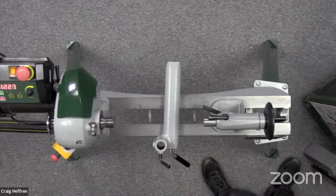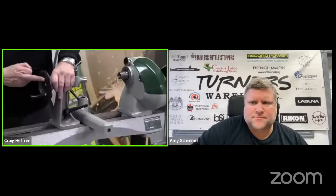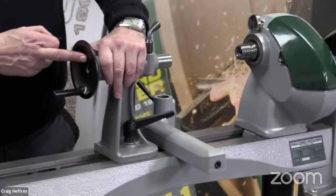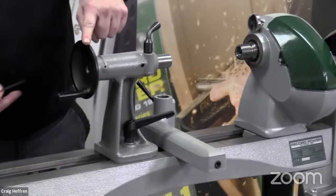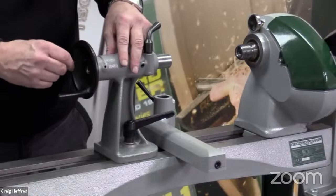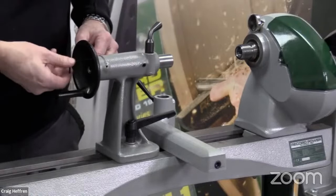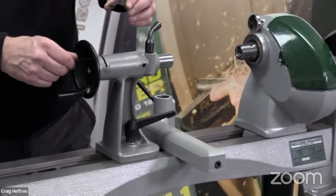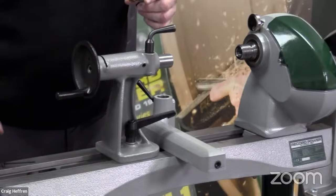Yeah. What you can do is, on the tailstock itself, there's a little bit of a hole. So I think you may well call this a little bit of maintenance on the tailstock. There's a hole on the main hand wheel of the tailstock. We can go in there with the Allen key, which comes with the kit, and we can just loosen that off until you'll find this keeper plate comes out, and it has done. That's nice. Must have done a good job cleaning this one.